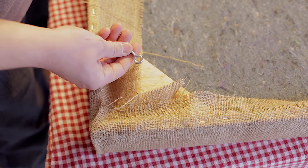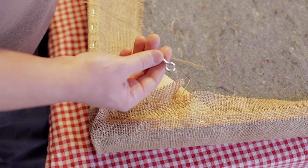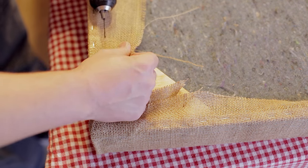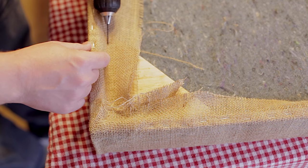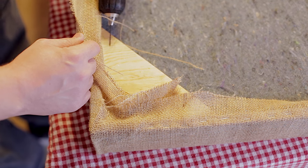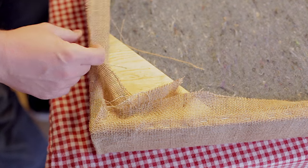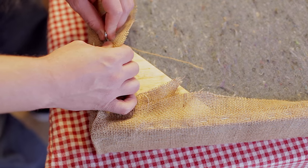For hanging this I'm just using some regular eye bolts — eye screws, number 208. I don't think it really matters, just short ones so once we put them in they don't stick past the frame. I basically just find the corner, have my drill bit at a certain length, and drill a pilot hole in the middle of that length somewhere in there. Then the eye bolt just sticks in there through the fabric.